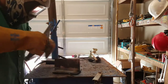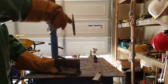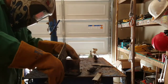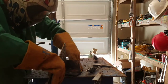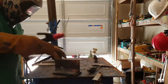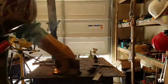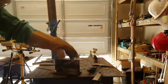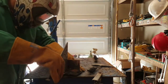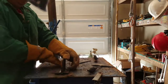Grab a little hammer or chipping hammer and do a couple tacks right there. Make it good. Check it again — it looks perfect, 100%! It has to be perfect! You can put the tacks anywhere you want — on the back, on the sides. As long as it's square and straight, you're perfect.